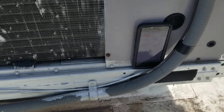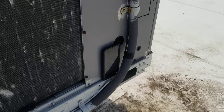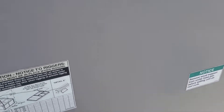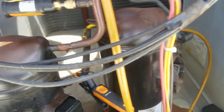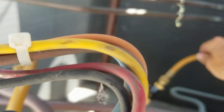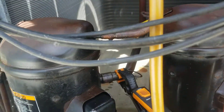We're staying right around 11 superheat, so we're right there. It should hopefully last a week or so until I can get back to either do the repair or replacement. That was taking refrigerant out of the one that's down - the high-pressure line has most of the liquid - and I hooked up a short hose with my core remover and just sucked it right out of the other circuit.